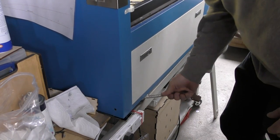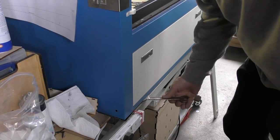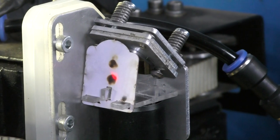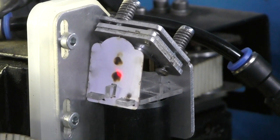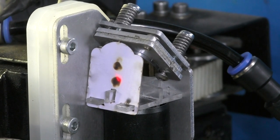Just in case somebody thinks I'm using the wrong corner to jack it up, let's go the opposite way. I'm going to raise this corner of the machine by half an inch or more and see what it does to my dot. We're lifting the corner up — see any change? None at all. So leveling the machine is not the answer to this question.